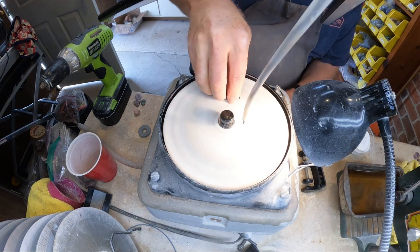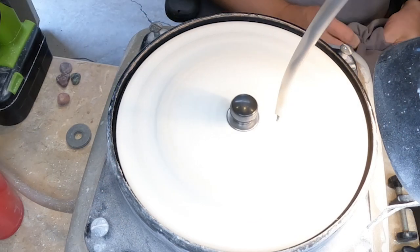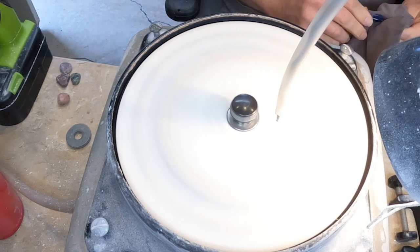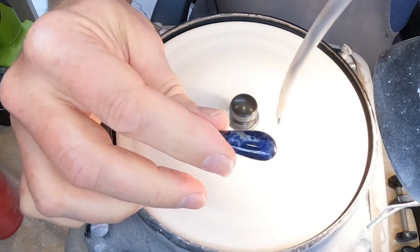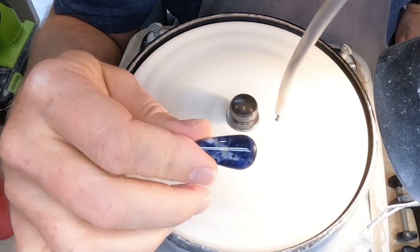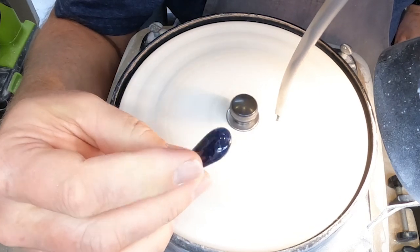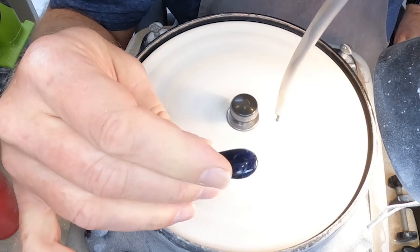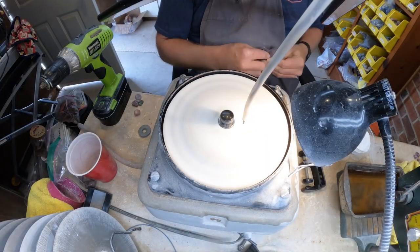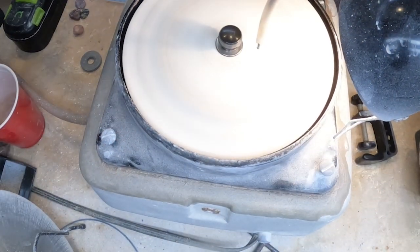At this point you can generate quite a bit of heat in the polishing process, but the water does help with that. I keep a bucket beside me that I can use to dip the stone in for washing it off and making sure there are no contaminants on the surface — I don't want to contaminate the grinding disc or the polishing disc either.